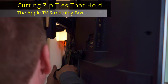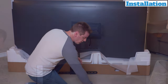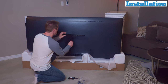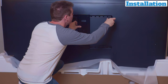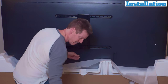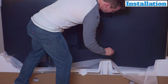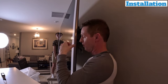What's great about this wall mount is that hanging the TV is very simple — it just hangs on a hook. These wall mount kits come with a lot of different kinds of bolts, and I found four that fit these holes. When securing the screws to attach the bracket to the TV, attach all four screws loosely at first and then come back and tighten them with a Phillips-head screwdriver. All four screws should be very snug and tight — you don't want any loose screws, as this could result in the TV falling. This TV is 90 pounds, so you will need help hanging it.